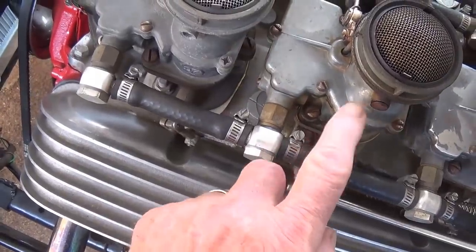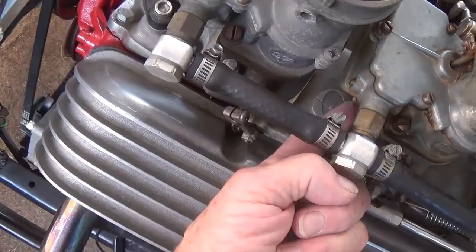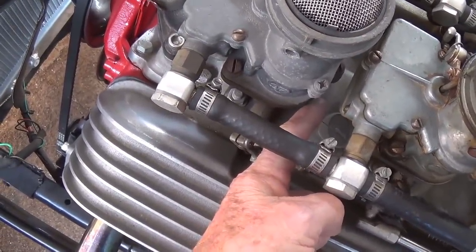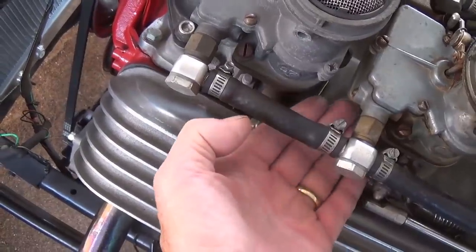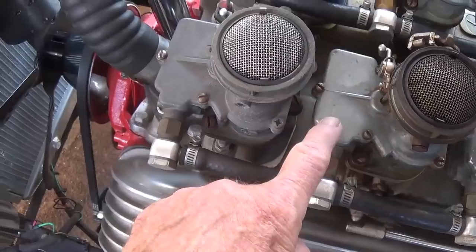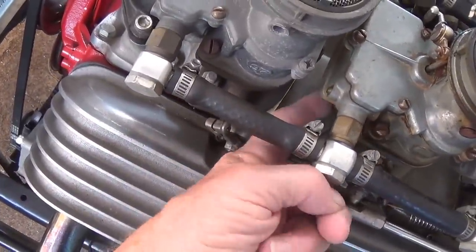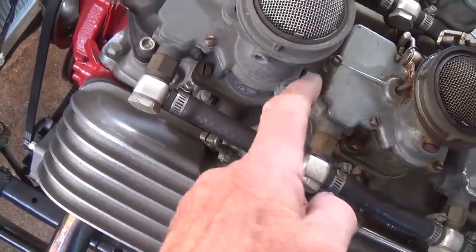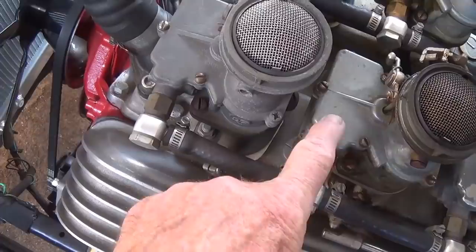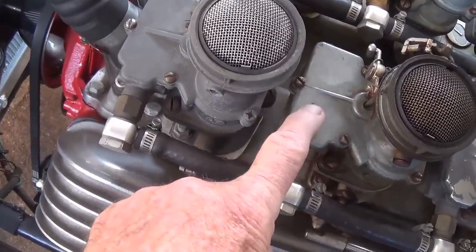Now that will insulate it from the heat that develops in the manifold, and have the spacer protrude out, say, this far, sort of like a diving board, to prevent the heat rising from the manifold from heating up the gas in the fuel bowl and boiling it. Sort of like a burner on the oven, and the water, in this case, gasohol, which unfortunately boils at a much lower temperature than regular gasoline. But that's all we can buy here, okay?